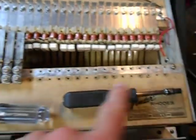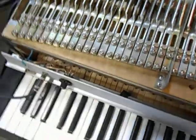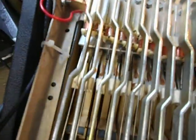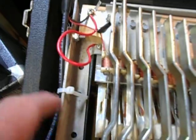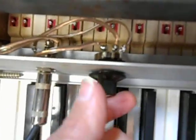I have this many more tone generator assemblies from here to clean, but all of these have been done. New screws and grommets cleaned. The electronics have been tidied up. There's no RCA jack. Got a good ground to put a new ground into the harp here. There was some green fungi over here. Cleaned that up. Put a new ground wire on. And here's my crazy jury-rigged new old stock 15K pot.